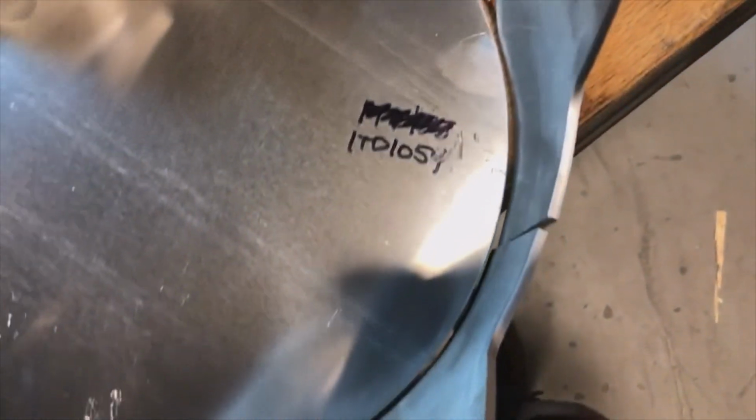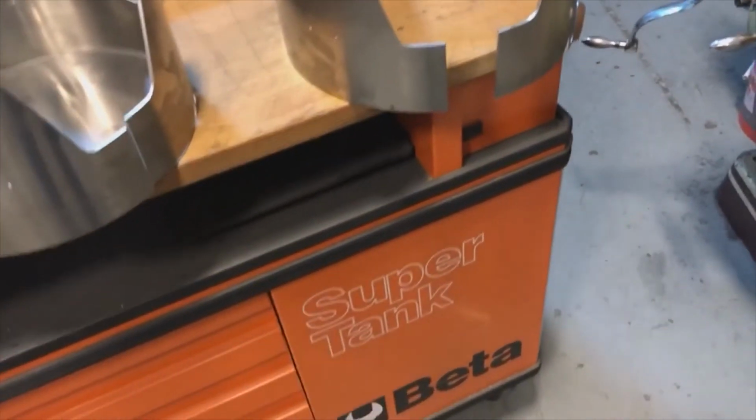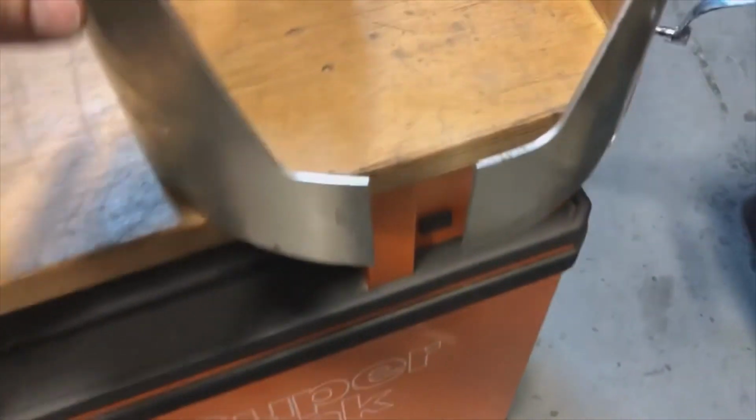Again, overall you have a little bit of air because the blank should be a tad shorter. I would say about 1/8 of an inch should do. Would make a better part. So basically immediately the first parts came out and are usable. Even this is usable. If you wanted to simply push this step, you can totally weld that. Then here, you just need to go like this and weld it, and it'll be a good part. Okay, so no reason to throw that away.